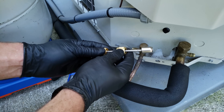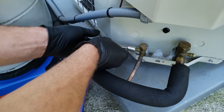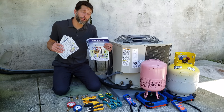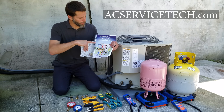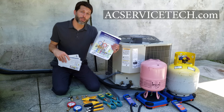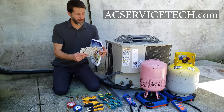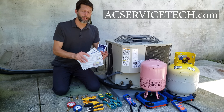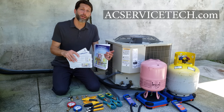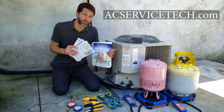After making sure the valve cores re-seated, go ahead and put your port caps back on. If you're in an area accessible to the public, make sure to have locking caps on your ports, and you need the proper key to connect and disconnect them. I hope this video helped you understand the procedures we use in the field. If you want to learn more about preparing a system for refrigerant, checking the charge, and troubleshooting methods, check out our refrigerant charging service procedures for air conditioning book at acservicetech.com/acbook. We also have quick reference cards with PT charts, refrigerant weights, and all kinds of information available at acservicetech.com and on Amazon.